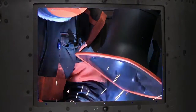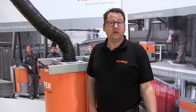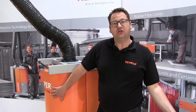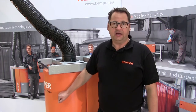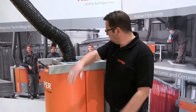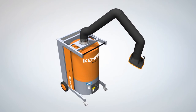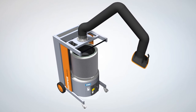After the particulate has been extracted, a cyclone pre-separator removes the coarse particles from the air. Subsequently the residual fine dust laden air is thoroughly cleaned in the special EPTFE filter cartridge. The cleaned air exits at the back of the unit into the environmental air again. The 50 square meter EPTFE filter cartridge is cleaned differential pressure controlled.